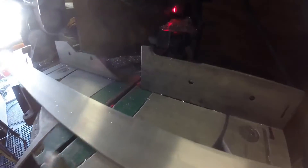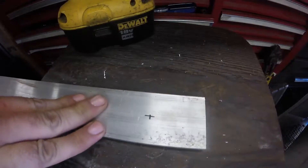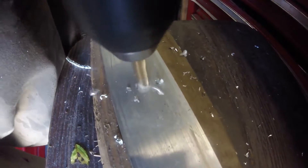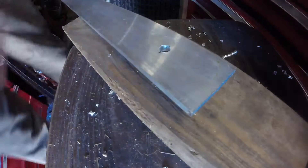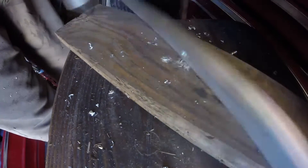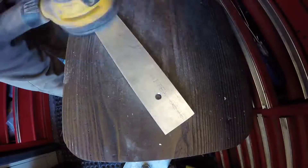This here is quarter by two inch flat bar, just cut to length. I'm going to have four mounting bolts in it evenly spaced, so of course they have to be drilled for those bolts. Once they're drilled we'll come back and deburr all the holes, and then use the random orbital DA to put a finish on it.